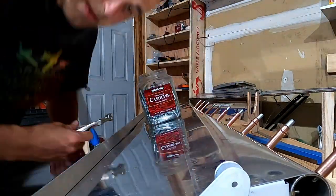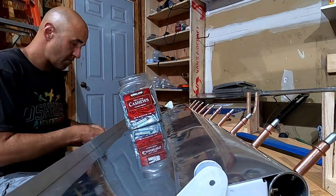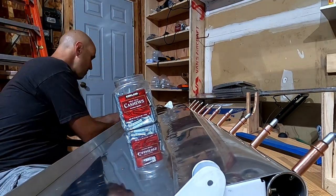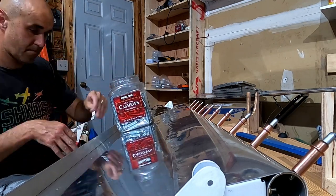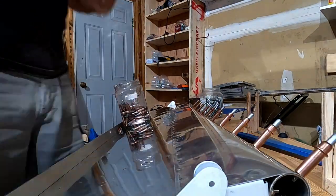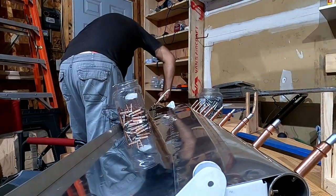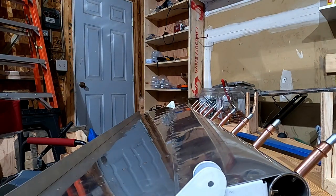I'm putting the trailing edge in — interesting, why am I putting the trailing edge in? I didn't glue it. I think it's just to clamp it together while I do the pop riveting, yeah — just to verify and make sure that it's all in the position it wants to be when it's fully done. I believe these are CS4-4 rivets that we're gonna put in here.